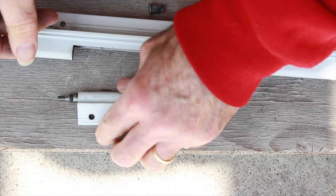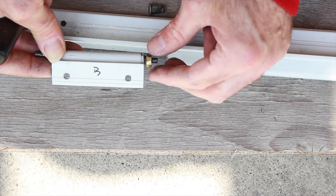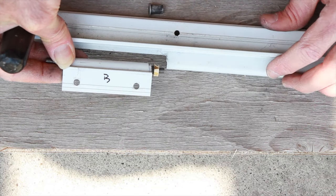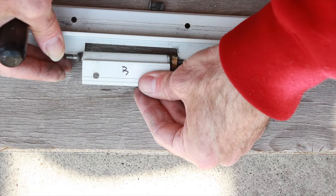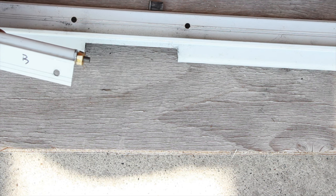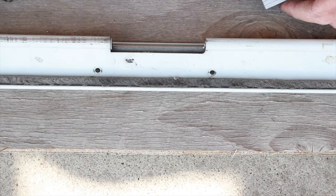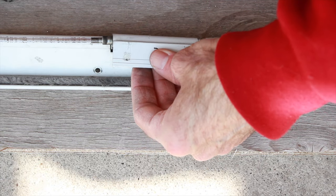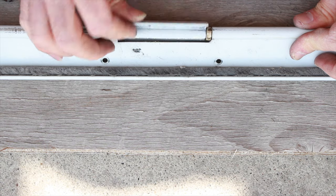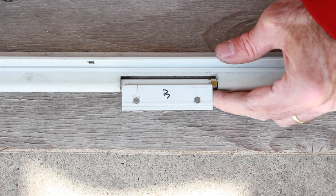It's right here — it's flush. That's where this pin is going to go in. Now there's not a lot of pin there and that insert can move down, which would give this some play. So if there's too much of a gap, there's an alternate where you put a 3/16th rod all the way up in the back side of this hinge. So the washer insert goes in, try to put this pin in first, back that off — there you go. You'll just do that for the broken hinges; in this case it's all four. And then we'll put it back up.